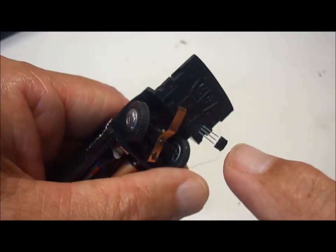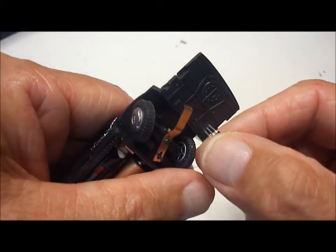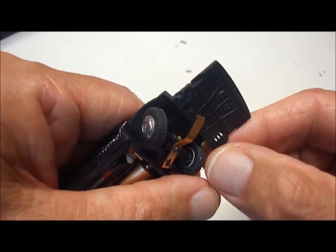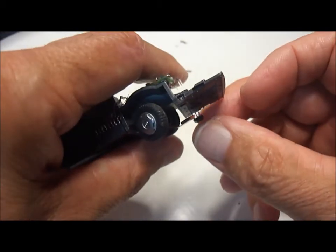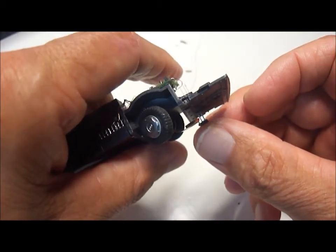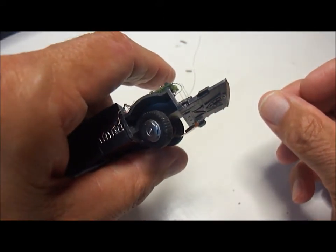The hall sensor is inserted into three holes made in the off side of the vehicle. At this stage you do not want to fix it too firmly, as you need to allow a little bit of vertical movement to ensure that the hall sensor is operating correctly.